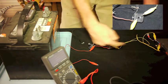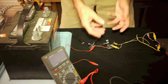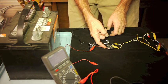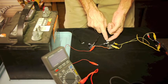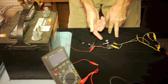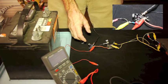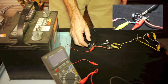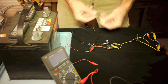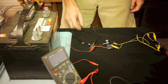The bridge rectifier came off another experiment and has a little cap on it, but I'm not really concerned about it. The SCR is not being used at all. The wire coming out has the negative DC and I connected a small wire to it and brought it over to three capacitors — each 10 microfarads, rated up to 250 volts. The three of them combined in parallel gives 30 microfarads, still at 250-volt capacity.